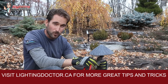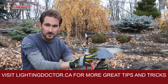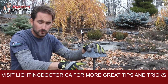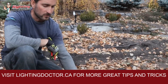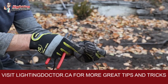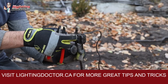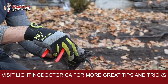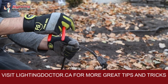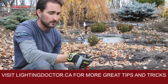That stuff is just not as relevant as it used to be with halogen systems if you're using LED. Anyway, good fixtures — they're halogen, we're replacing them all with LED. The key thing I want to point out is the connections. You see these a lot at big box stores — it's a clamp-on device where you stick your wires in and it just pierces into the wires. The problem is anytime you start poking holes into wire that's buried underground where the soil is moist, with rain and all that — what do you think is going to happen to that wire over time?